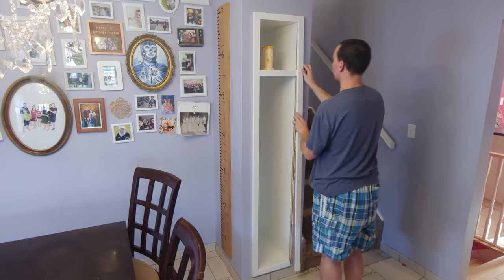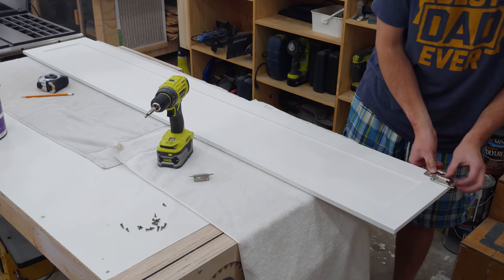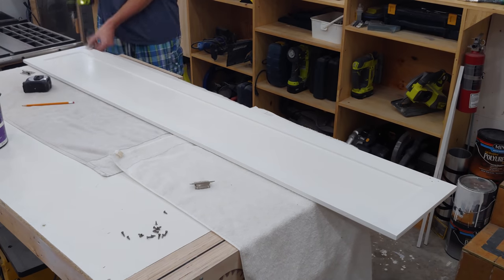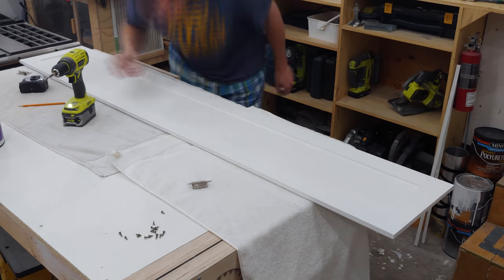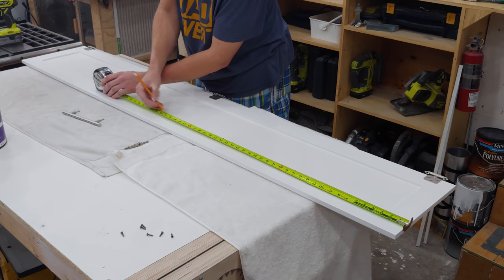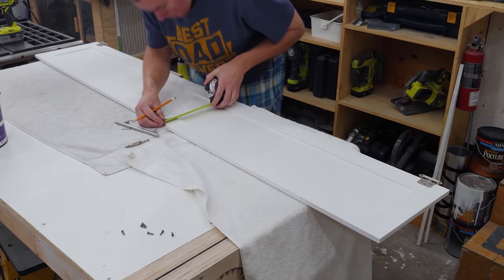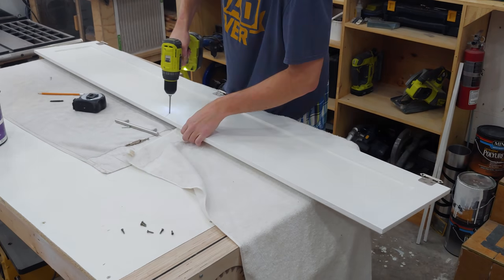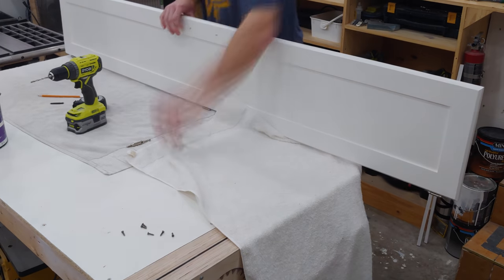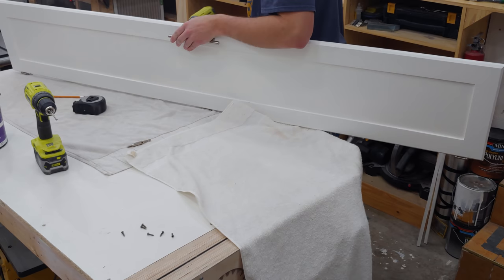The same is done to the other side and it's back outside to the door. I start by marking the center of the door on the back side for the center hinge location — the two end hinges will be offset by the width of a hinge. The hinges are laid in place and a self-centering bit is used to drill pilot holes for the screws. To mount the handle I first mark the center minus half the distance between the screw holes, then mark the center of the stiles and drill a large hole to allow the small bolt to pass through. The handle is then screwed on and the door is complete.